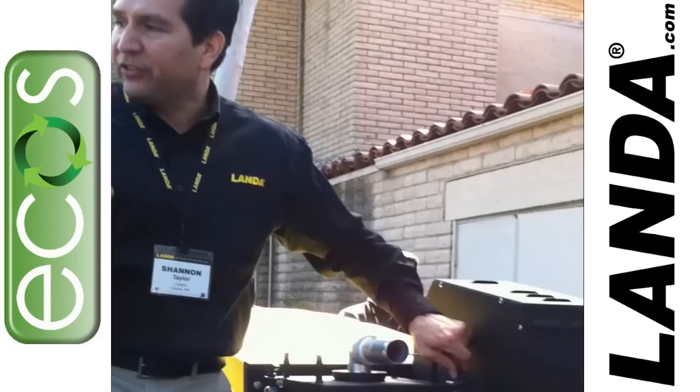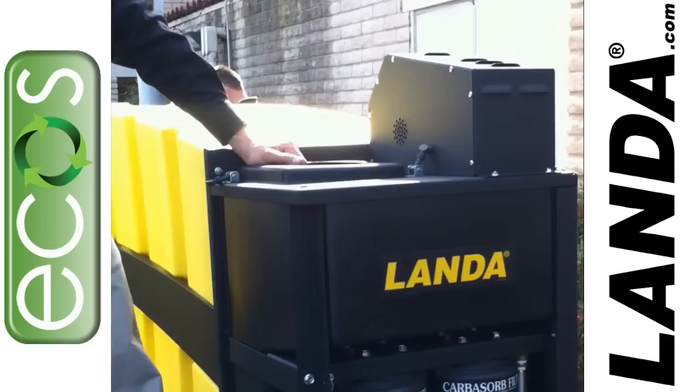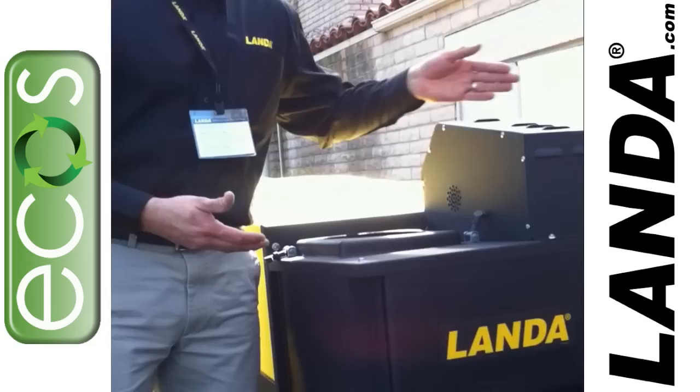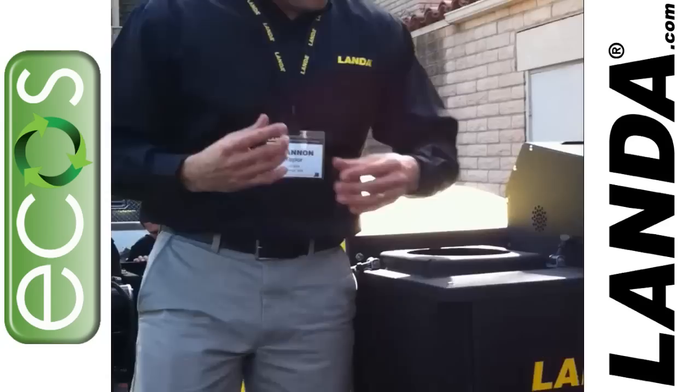The bag is attached with just a metal ring — you tilt it and it slips off. All these parts will be available as spare parts. Inside the vacuum tank, we have two quick-acting floats: one signals when there's no water so the feed pump shuts off, and the other at the top shuts the vacuum off when water gets high so we don't start sucking water out. There's also an oil filter absorbent bag inside with a carabiner clip. We're looking to find a smaller one that fits better in the cavity.